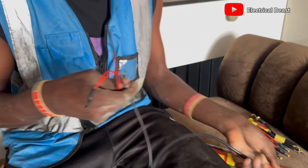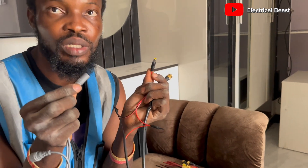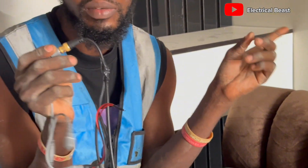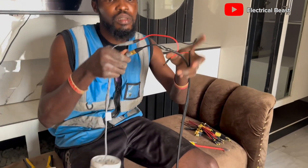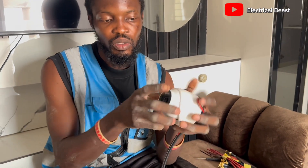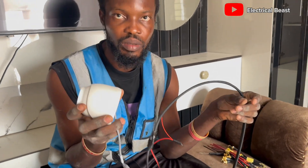Normally when you have this kind of connection at the terminal point of your camera, this is what you connect to your camera. This is the female connector and the camera has the male connector — you join them together. This one sends power to your camera, then the video comes back through the BNC to the DVR recorder. Normally all of these connections and cables will be placed inside a box — a sizeable adaptable box — then you can fix the camera on top of the box or on the wall. I'm going to do a separate video on how to fix the camera.